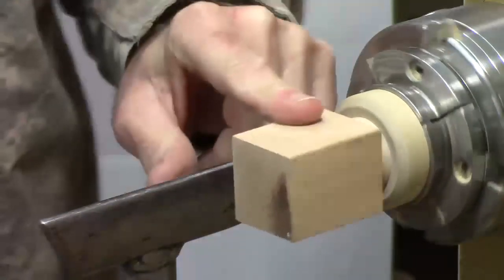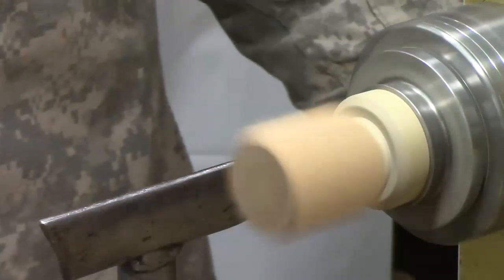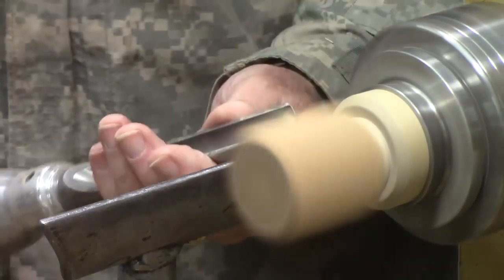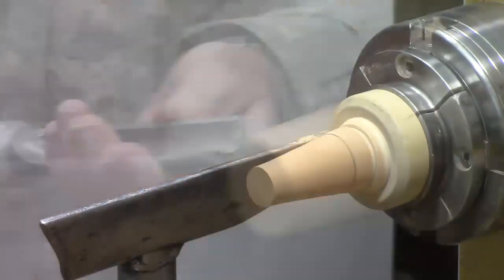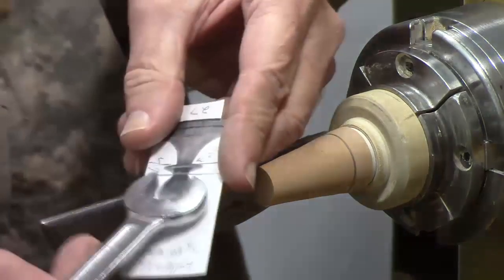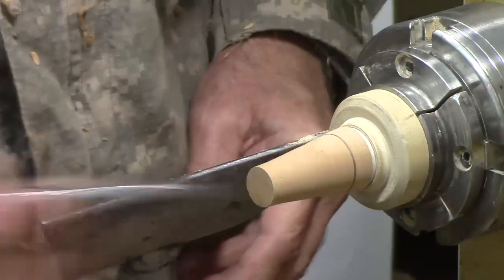For these pawns, this is short — I don't need to worry about tailstock support. I'm going to turn it at very high speed and rough this round with easy light cuts. Turns out that 5/8 inch matches that ball head, so I'm just going to turn this down.